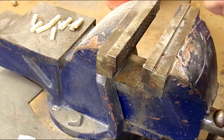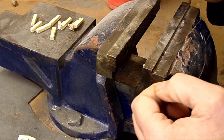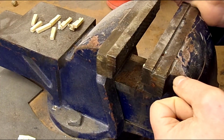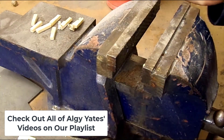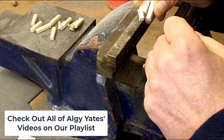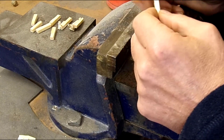Hope that's of interest. There are all sorts of other tests that would be carried out. In my past we would have carried out tensile and torsional strength tests on various components in a scientific format with strain gauges. But here we're just using the standard three-leg system, which is the approved method for testing the shear strength of glue for a batch.